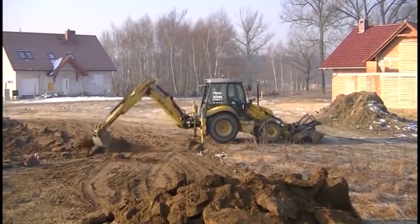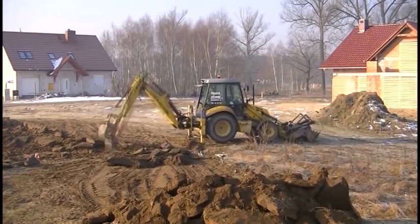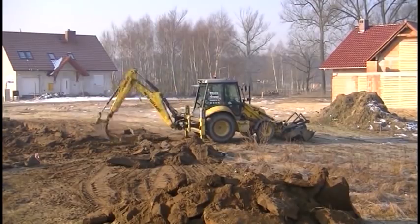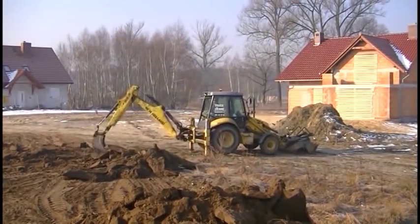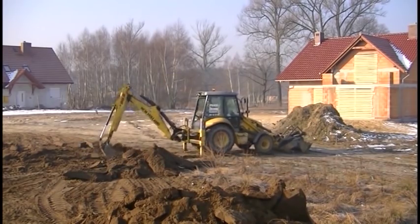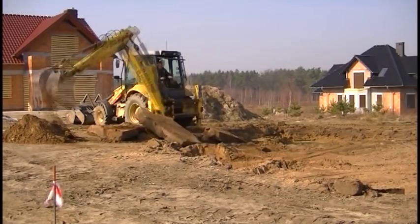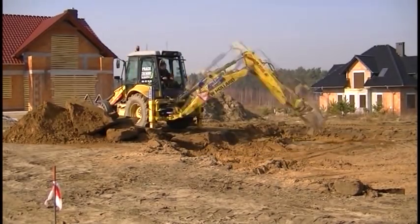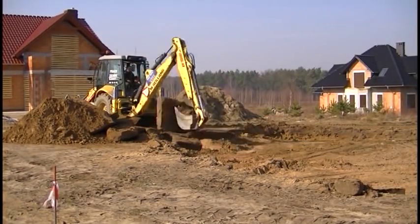This presents a really difficult challenge for a backhoe loader — please notice how large the frozen blocks excavated by the operator are. Such conditions are reflected in a considerable prolongation of equipment use time. In normal conditions, removing humus takes around 2-3 hours. In this case, however, it lasted more than 9 hours, which resulted in a threefold increase in cost compared to the planned budget.